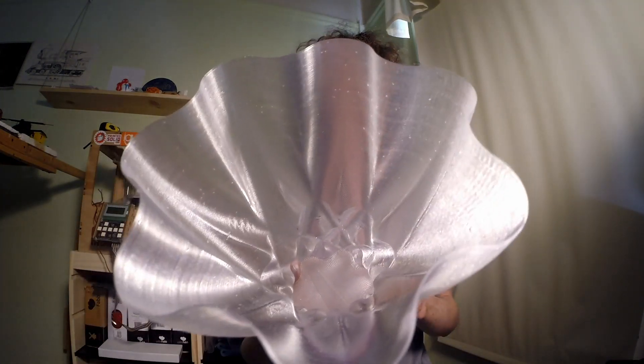In the case of this print, it was done using Cura with Vase mode at 0.5mm layer heights with a 30mm/s print speed, 255°C on the nozzle, 80°C on the bed, and about 50% fan cooling. You don't want to go blasting the material with 100% cooling, as you do want the previous layers to stay warm, but a little bit of cooling helps so the material doesn't droop or cause heat buildup distortions — especially in tiny parts. I highly recommend running a little bit of fan speed, varied as you go.